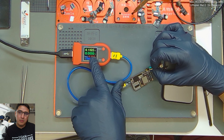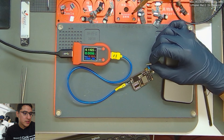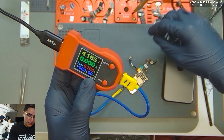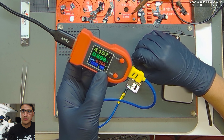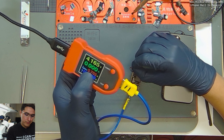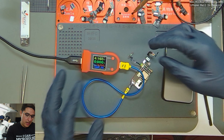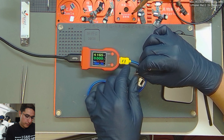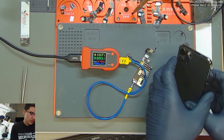Take a look at the amps — the green number. I'm going to click the button now. I'm holding the button and you can see how that number is jumping: zero, then some number, zero, like 200, 700, etc. — that's not normal. Once we fix it I'll show you what normal looks like. One of the good things about using a DT880 is you start recognizing these patterns and can quickly find the problem — certain shorts give you certain patterns.